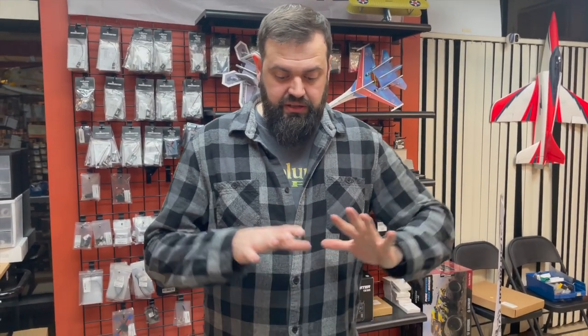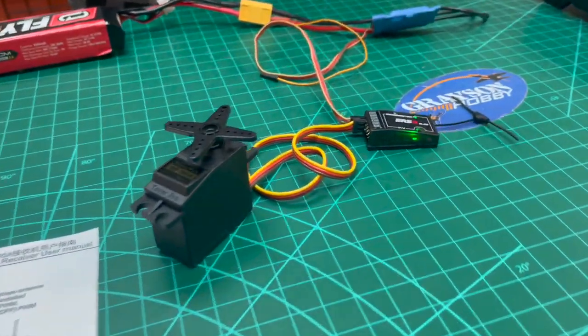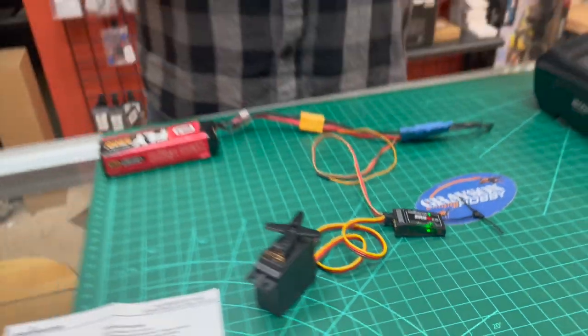It's like a Bluetooth lock. Unlike the FrSky receivers and some other receivers, on the Radiomaster with ELRS you don't have to do any frequency tuning — it's just paired and go. There are adjustments you can make for packet rates, whether you're running digital servos and want super low latency or longer range. Best thing to do is go on the ELRS wiki page and learn about how to use your product.